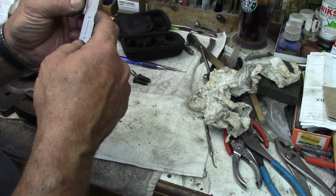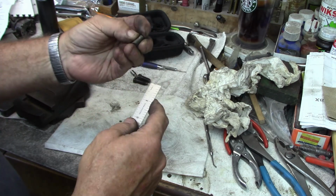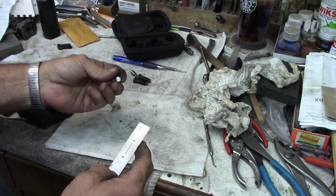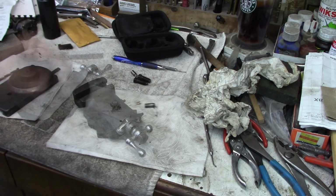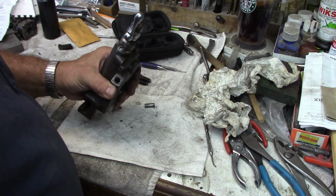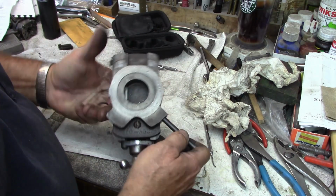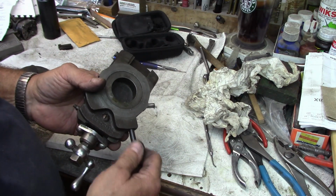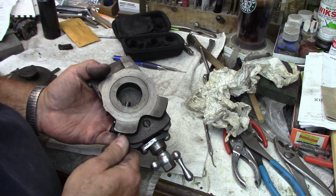So what I would do, and I'm going to say this is the proper length, it's about, well, if we make those 7/8 of an inch long. So with a 2-inch piece, we're going to have plenty. Let's make it out of a 3-inch piece, and we'll cut them both. Now, before I got too carried away, I guess I should have shown you, although I already knew the answer to this question, our pins have to fit into our compound. So when we slide them in, 5/16 fits right in there. So that will be just perfect for our applications here.